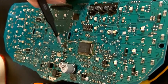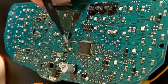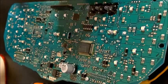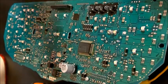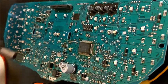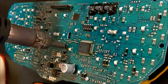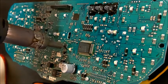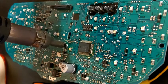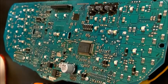This is the chip we're going to be removing. The easiest way to take it out is with hot air so you don't have to mess with any contacts. Another way is to put solder across all the pads and use a soldering iron to lift, but I don't like that method. Get a hot air station, heat up the chip — it shouldn't take very long. And that's it.